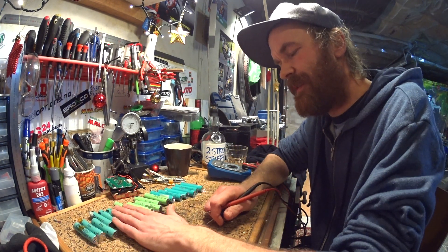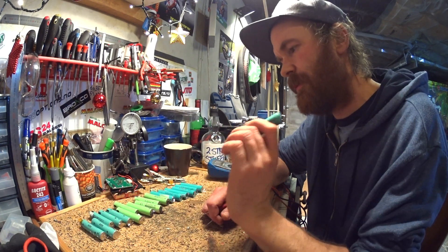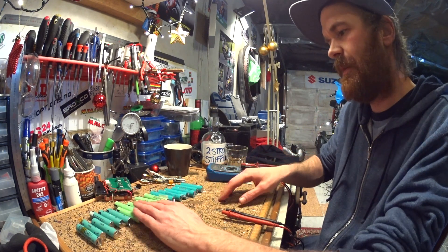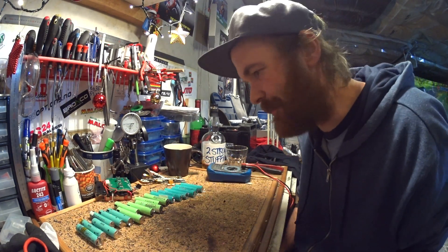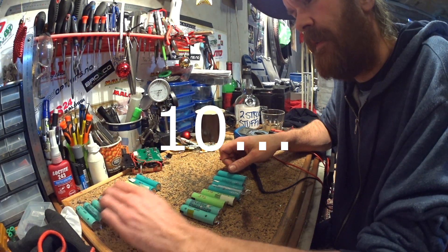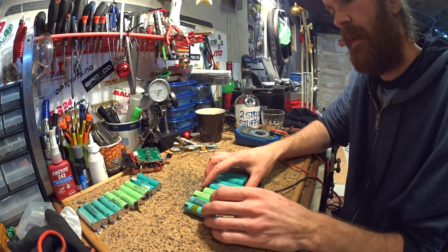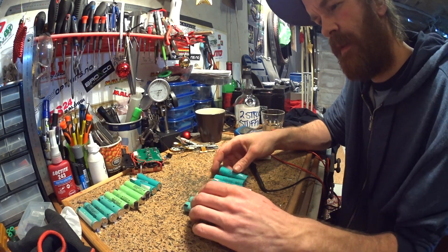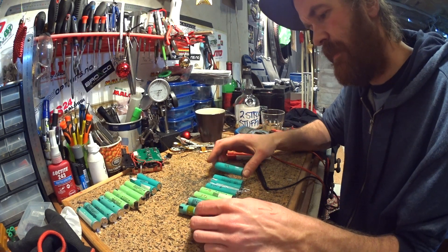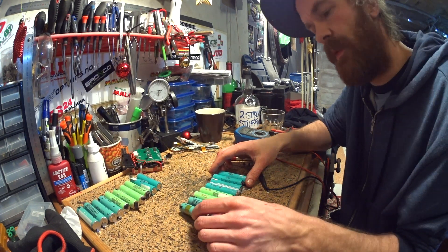If I'm lucky and there are enough good cells, I'll build a 4-cell battery at 14.8 volts. The cells are 2.25 amp hours, so two in parallel should be sufficient to drive the ignition. I'll try a homemade LiPo battery — I'll also need to get a charger. After measuring all the cells: 8 batteries came in from 2 volts up to 2.5 volts, so those are probably bad. But there are also 8 cells from 3.3 volts up to 3.8 volts, and I think those are good. That means if those 8 cells are all usable, I have enough to make a 14.8 volt, 4-cell, 4.4 amp hour battery.